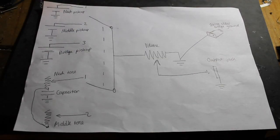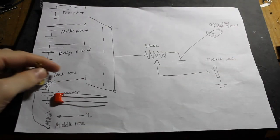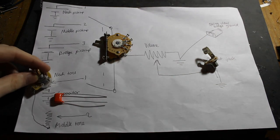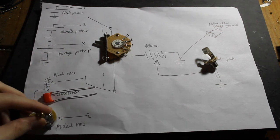Here you can see the entire circuit in your Strat. In comparison to all the wires you saw at the start, there's really not a lot going on. The main reason is that most of the wires are coming off the pickups and the tone, and most of that is just done in the switching. So the circuit itself, at any one position, really doesn't have much connecting to each other. If that doesn't make sense, let's put these next to the symbols. This is our switch, this is our neck tone — a potentiometer — this is our capacitor connected to the tone, middle tone is also a potentiometer, and volume is also a potentiometer.